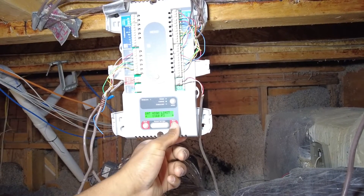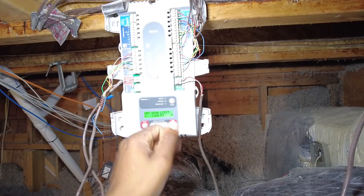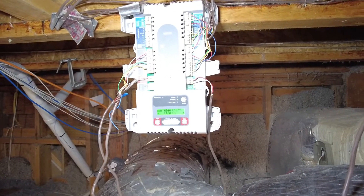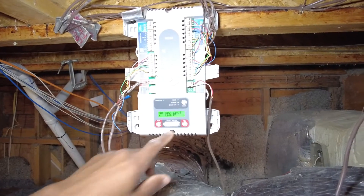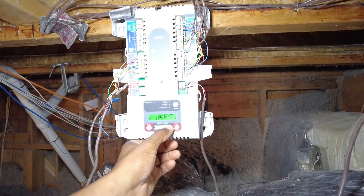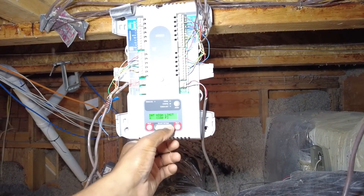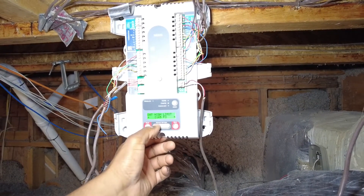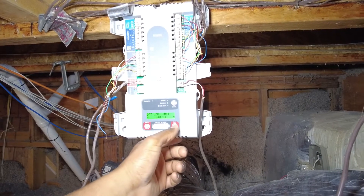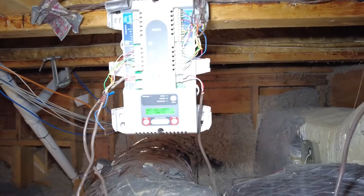Discharge sensor: yes. High limit temperature for your DAT is 160 degrees, which should be good. We can take it all the way to 180 if we wanted to, but let's do 160 — that's pretty decent. Low temperature: 40 degrees. That's a pretty good limit.